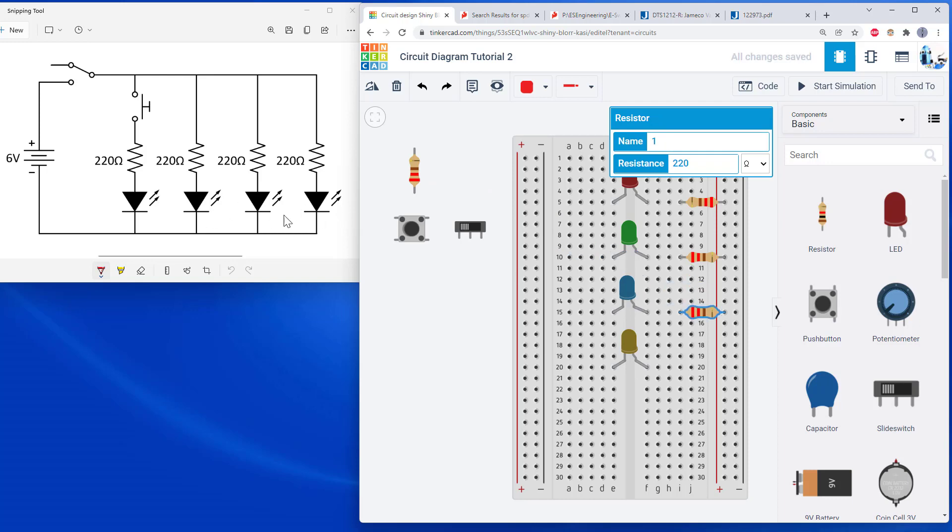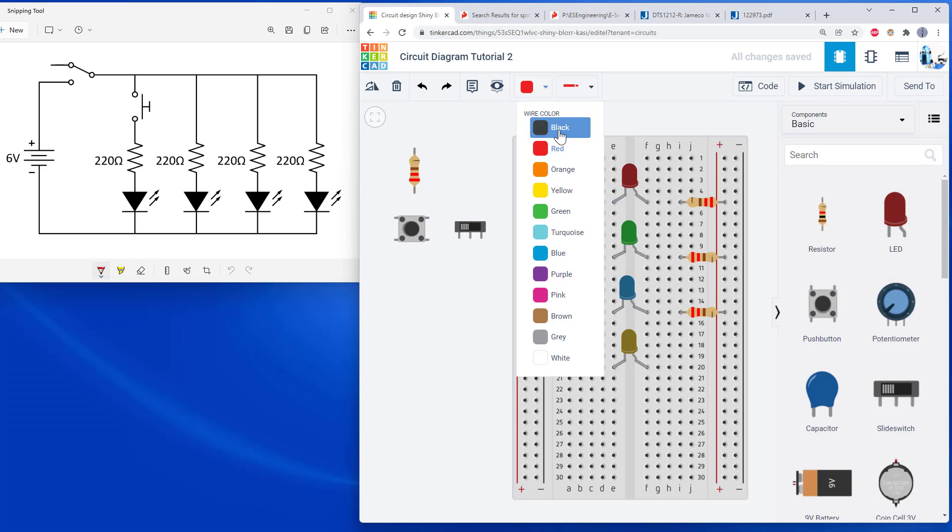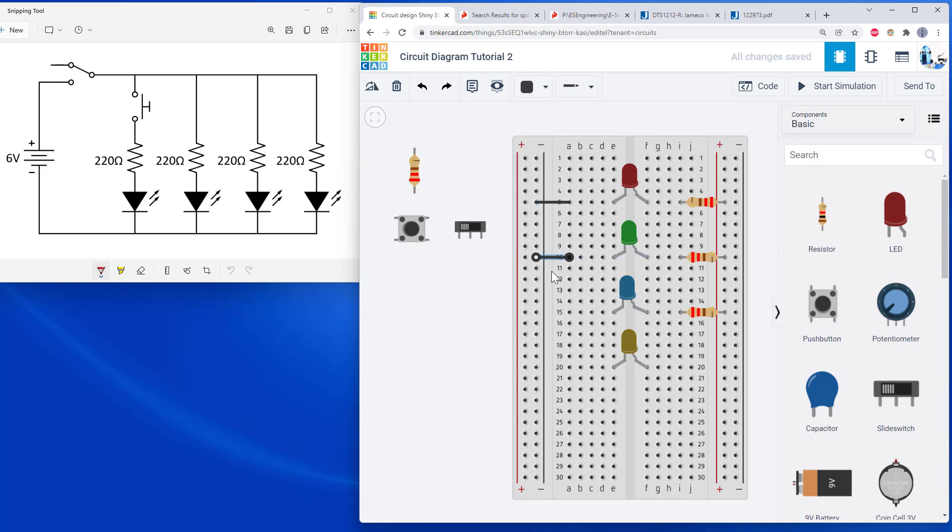One branch has an extra button in series with the resistor. Note that I haven't labeled the colors of the LEDs in the diagram — I just picked one of each color arbitrarily — so I'm choosing to put the button on the yellow LED. The other side of each LED is connected to ground. I'm going to use jumper wires to go over to my ground bus, using black for ground as per color coding convention. Since we're connecting to power and ground, I need to think about how to connect the battery pack.